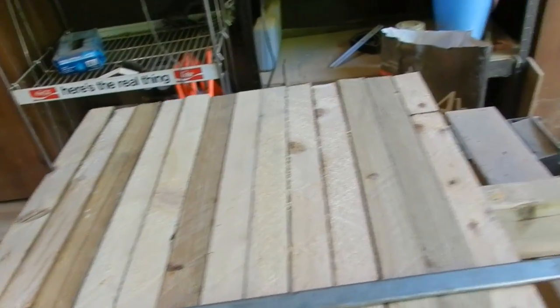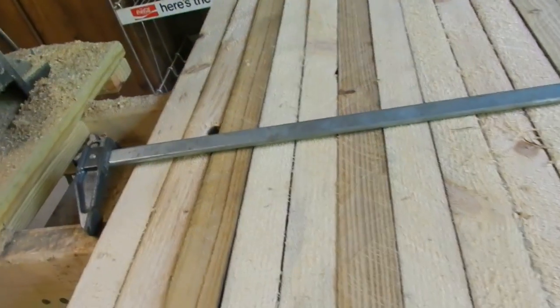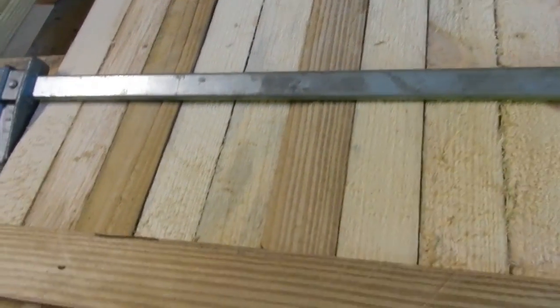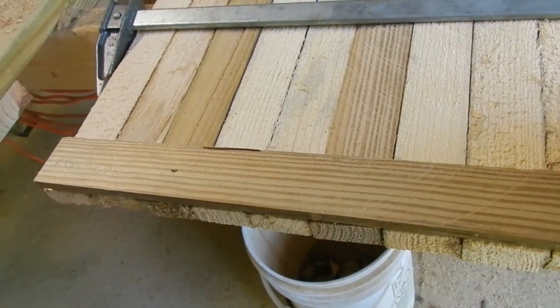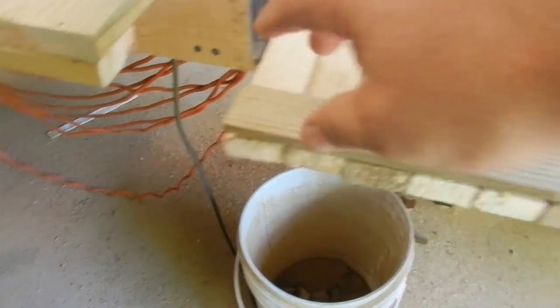You can take a saw and go right down it to make it even. You're going to need some large clamps to hold them together while you screw on the end pieces and saw it down. These are two very thin pieces of wood, different sizes. I'm not worried about it because it's going to be the back. We're going to put one down here and one up there — at the very edge or just off the edge, it's up to you. It's going to hold them in place. Mark through at the end, take a pencil and score it underneath, then take it to your miter saw or whatever saw you have to cut the end off. Now that's cut to length.